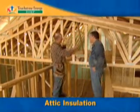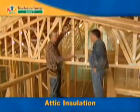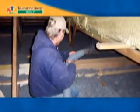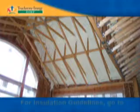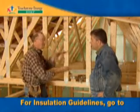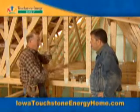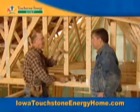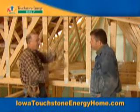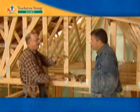As you can see, this is the attic, and normally you wouldn't be able to see this at this height since we're up above the hallway. We're going to eventually blow about two feet of cellulose in this attic. We blow it two feet, which seems like a lot, but when it's blown it has a lot of air in it, so it'll settle. We want to make sure we have a good amount of insulation in this attic — that's a touchstone energy standard. The R-values do change depending on what part of the country you're in. Here in the Fort Dodge area, or the southern part of Iowa versus the northern part, it just depends. Touchstone can give you all the R-values you need for your specific area.